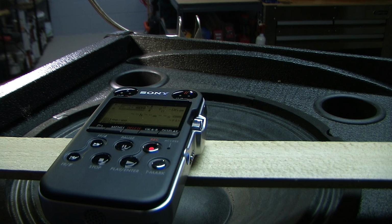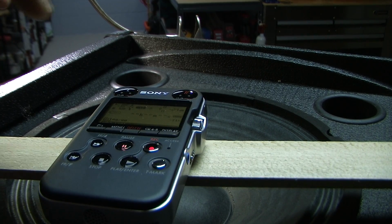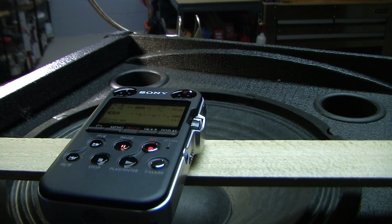Got a -8 at 3.2 kilohertz. I get -13 at 4 kilohertz. So relative to 1 kilohertz, it's somewhere between 3 and 4K. Let me turn this down. I just picked 1K as a reference point, but relatively speaking, the -3 dB point is between 3 and 4 kilohertz. So I'm going to go with 4 kilohertz. And then let me get rid of this stuff and take this speaker away, and then we'll do the numbers and find out what capacitor to use.